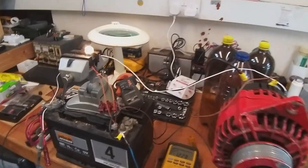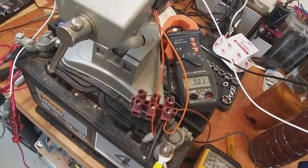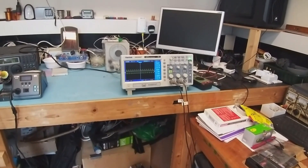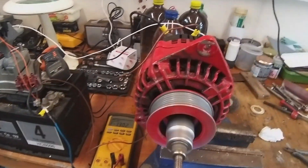Let's test that. Okay, there's a load on there — we're coming up to 12.7 volts, three and a half amps on the current meter, and the bulb's gone out. At the end of the test the output voltage got up to 13 volts, current output was about 3.3 amps, and the frequency measured on the scope was 115 hertz.